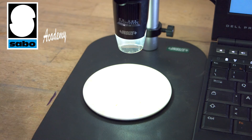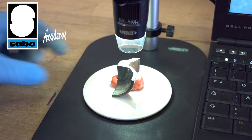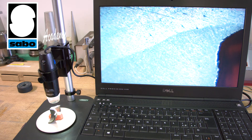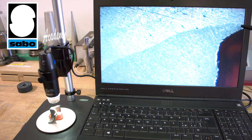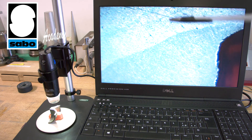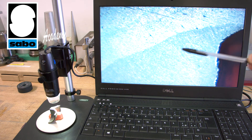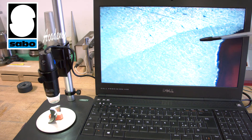After polishing and an acid bath to highlight the different structures of the metals, we can observe the profile of the coating material zone and the base material. In this case, it is important to check penetration on the side, which, as we can see, is plentiful and complies with project specifications. The component has passed the test and consequently the welding procedure can be executed correctly.